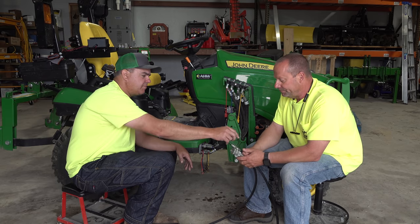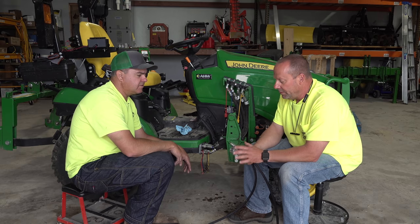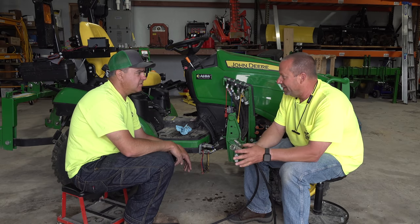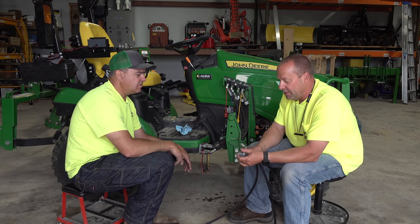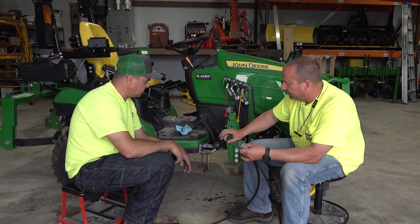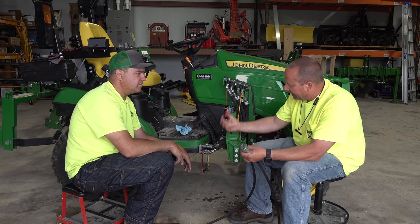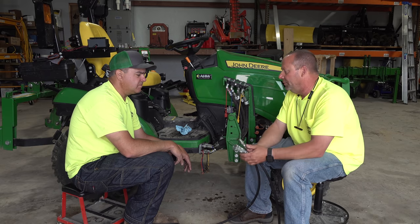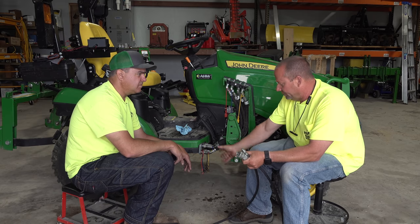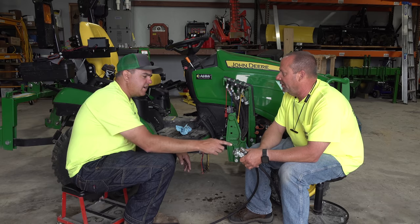The male couplers are inexpensive. The female couplers are about twice as much, usually about $18, $20. They're a lot harder to change, obviously, because on a 1 Series, they're held in this bracket with a circlip, and you have to get under there and disconnect the hard line. But that's unfortunately the only viable option, other than putting down a box of cat litter or a drain pan.